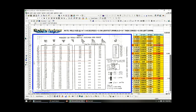That gives me the triangle shape, okay? So I got that. I copy the same down here for 3/8, and I got the 239 right here, which is matching this under the 45 degrees. And then to the right with the 10% increase in leg, perfect match.